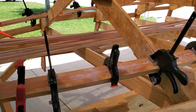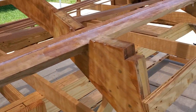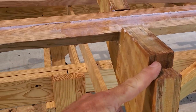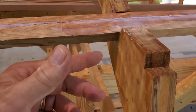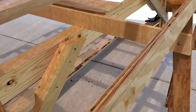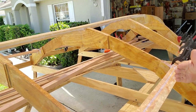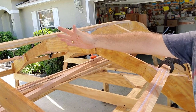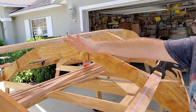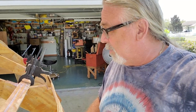There's going to be a lot of work shaving down these frames to get the plywood to fit, and there's also going to be an accessibility issue. I don't want to put my outer chine in because it just brings me that much further away from the center. I'm going to remove these temporary braces so I can get that much closer in to the keelson to do my shaving. There's just no reason to keep these temporary braces on right now because the inner chine is holding it like it's supposed to.